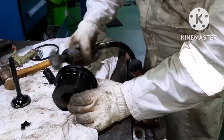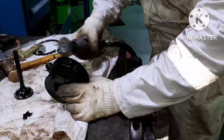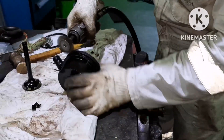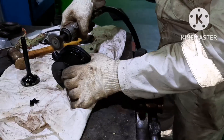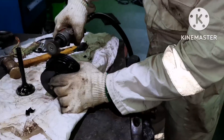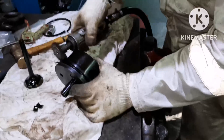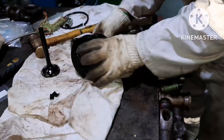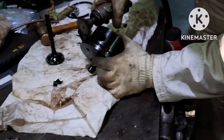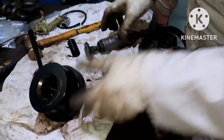Always make it a practice to clean the suction valve before doing the overhaul. Also, the O-ring slot and O-ring groove should be cleaned properly because the O-ring sometimes gets stuck in it. If you want to fit a new one, at that time it won't get inside the seat properly. That's the reason I'm saying you have to clean the O-ring slot properly.